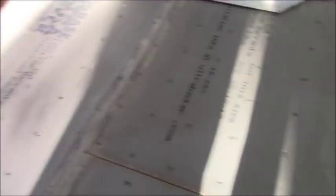It lasted, and now we have new backer board. Once they got out all the flooring material, I was able to just nail this backer board down to the floor — easy peasy. It didn't cause any distress to the plywood below, and the customers didn't have to pay more for their job because I didn't have to spend five days taking all this stuff up and ruining their subfloor.